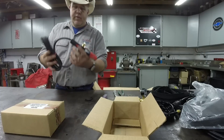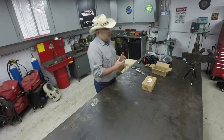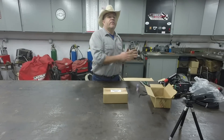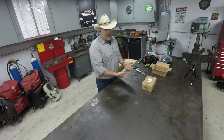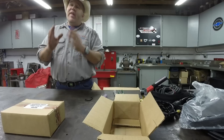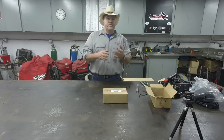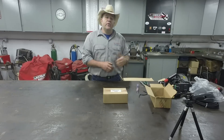This machine also comes with an electrode holder, also called a stinger. Here's why: a TIG welder is what's called a constant current machine, meaning wherever we tell it we want the current to be — usually via our foot pedal — it will deliver that same amount of current consistently until we tell it to stop. On an old stick welder you've used around the farm, you set the dial to whatever current output you want, strike the arc, and weld. That machine gives you that current until you break the arc. So both a TIG welder and a stick welder are constant current machines — which means you get two welders in one package. Yes, it's a stick welder too.